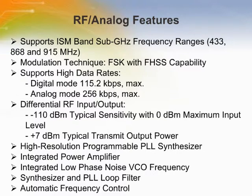The MRF49XA has low phase noise and provides an excellent adjacent channel interference bit error rate, BER, and larger communication coverage along with higher output power. The MRF49XA device's automatic frequency control, AFC, feature allows for the use of low-accuracy, low-cost crystals.